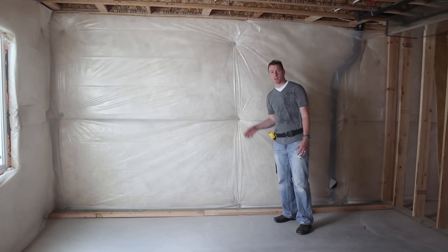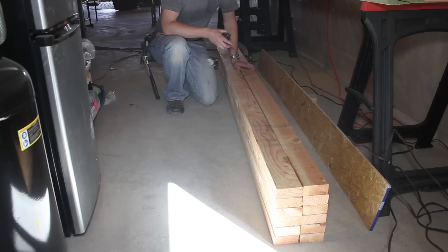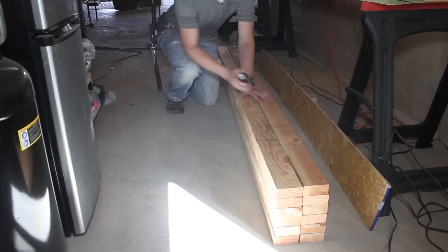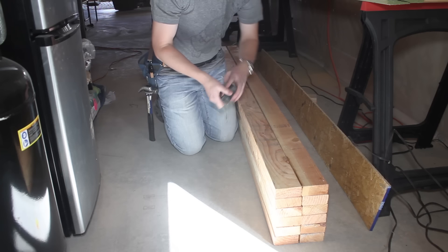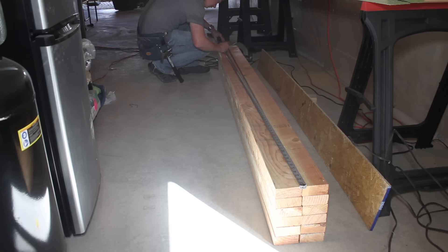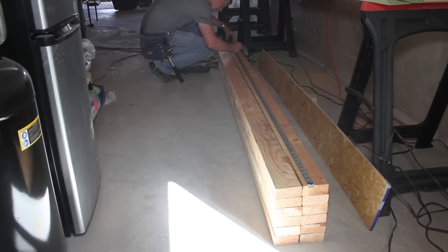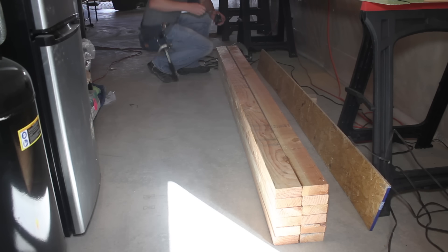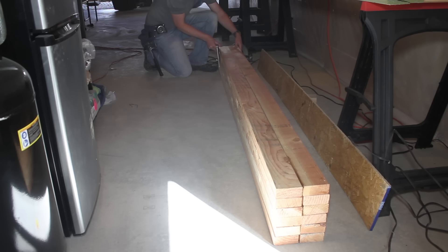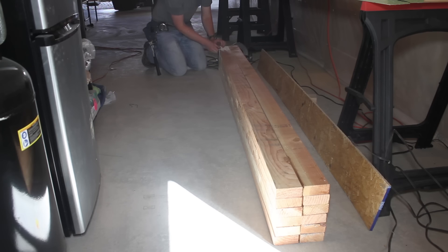Now that we've got our lines made all the way down the board, we'll count them up and know how many studs to cut — I think it was 88 and five-eighths. A couple of quick tips for getting a whole set of studs cut: line up all of one end so you can get one measurement instead of measuring each board individually. I'll take this down to my 88 and five-eighths mark, mark it on the boards, then use my speed square to mark it across and bring it down the side of each one. That way I have my measurement marked on the side of each board, so when I take them to the chop saw I'm ready to go.